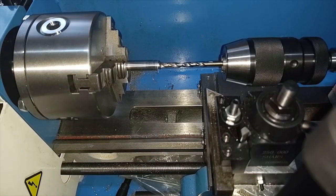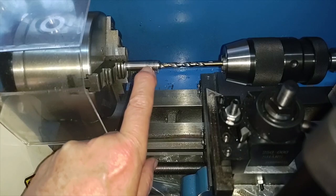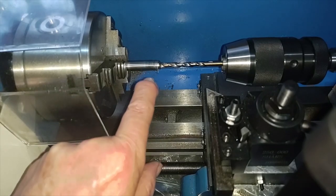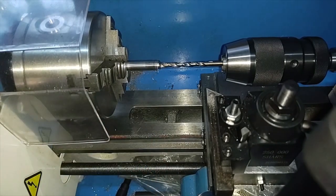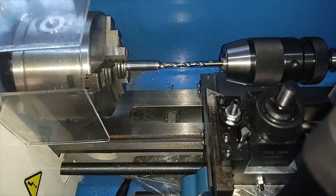We're going to drill this out and put in a very small cross hole halfway through, and we'll put a zerk fitting on this. This is the pivot pin — one end of it obviously — for the step. The idea is, although I'm going back to the standard bearings, that way I can shove some grease in them and help keep them cleaner over periods of time.